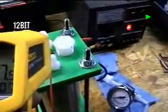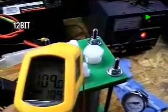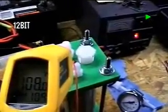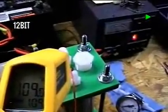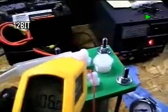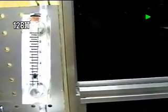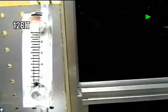Back up to the outbound gas — we're at 109 degrees. So you can see there's a big temperature drop right there between the generator and when it gets out there. Of course it is going through the bubbler, which allows it to scrub the KOH that may be in there. And we are still oscillating at a pretty good rate — from 0 to 2 liters in a steady pulsing manner. That's at 12 volts and 10 amps.